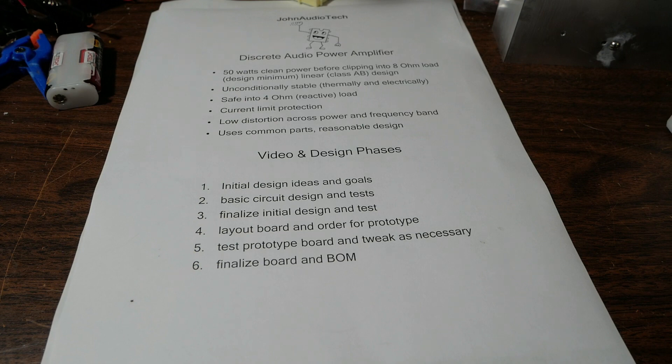I shot about 40 minutes of unedited video and decided to break it up since it was getting quite long. In the next installment, I'll begin looking at the design of the circuit — figuring out the supply rail voltage, looking at current in the output transistors running with a 4-ohm reactive load, and moving on to beginning the circuit design. So at this point I have to ask you, the audience: is this something you'd be interested in? Not necessarily buying a kit, but just watching the video series and going along through it. Leave your comment down below. Thanks for watching.